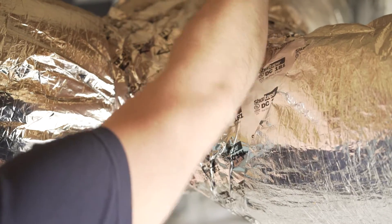Step three: apply the tape with a squeegee centered over the seam you are sealing, allowing it to stay unwrinkled over smooth surfaces and conform to uneven or textured surfaces.